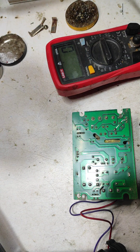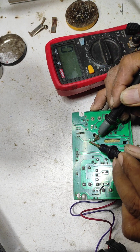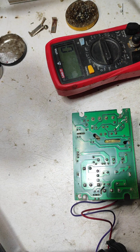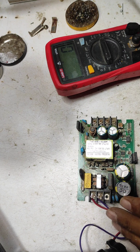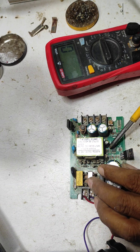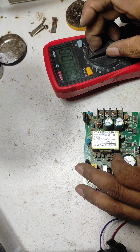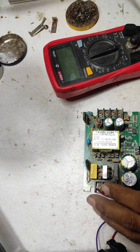On this capacitor, 12V is required for IC switching, but no supply is here. What is the possible fault? Possible fault: this IC can be shorted, or there are two resistors used for supplying this IC — their value is 474K.